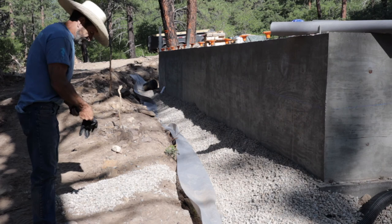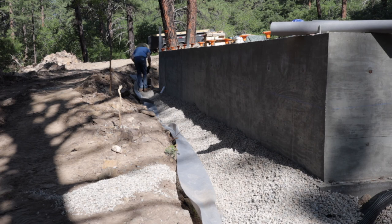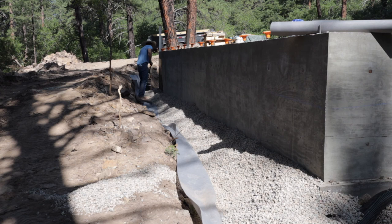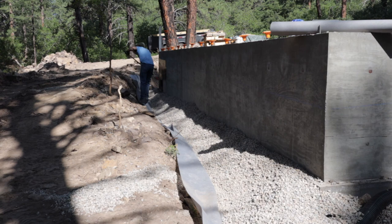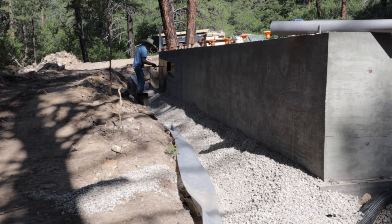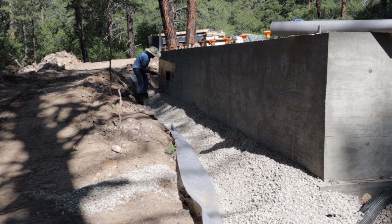The next day I get right back at it, and this is when I started on the waterproofing. And what I did here was I snapped a line, the slope of the grade that I'm gonna have, and this is gonna slope from front to back. I'm gonna slope it about 2 feet in 34 feet. That should get the water running off really nice away from the garage. I'll slope it away from the garage and then also to the back of the garage. And basically when I do the grading, I'll follow this waterproofing mark.